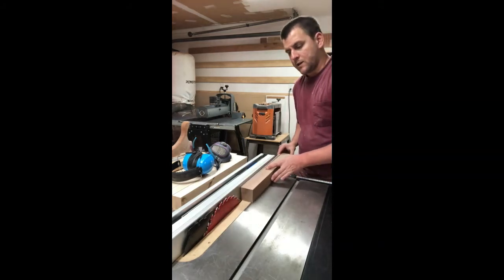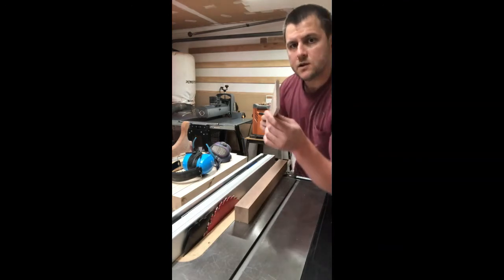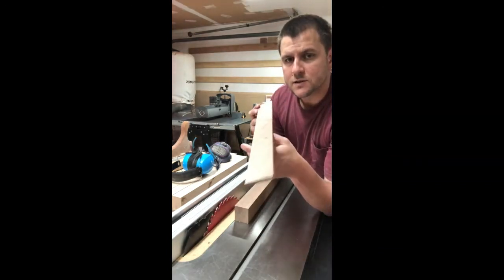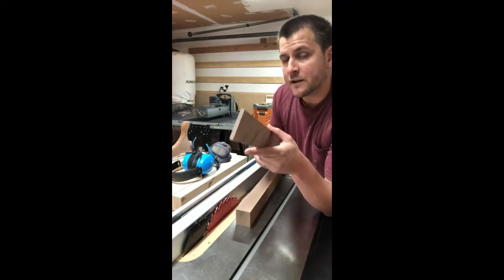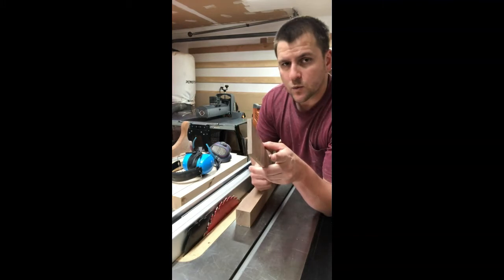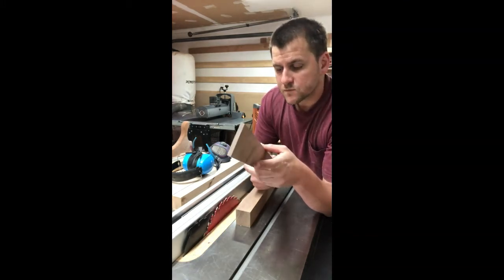We're going to be cutting 1/4 inch passes, so you're going to end up with a 1/4 inch thick piece at 2 1/16 inch long, at your 20 inches in length. You need 12 of these total. I should be able to get 5 out of each block, depending on how much you planed off of it. Depends on how much you get, so that's why I cut 3. You'll need 12 total. So that's what we're doing next.